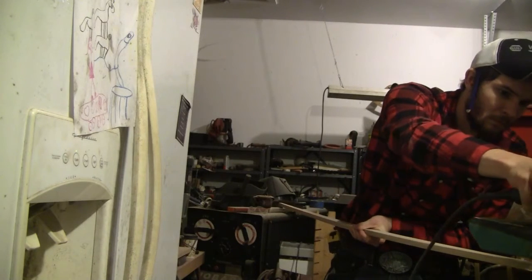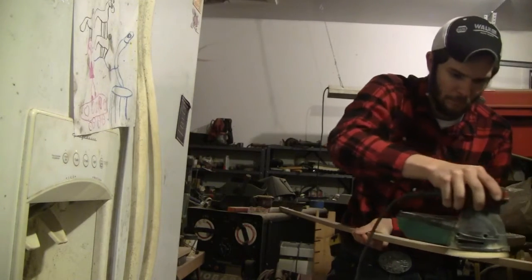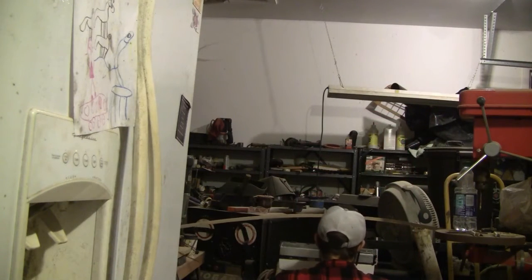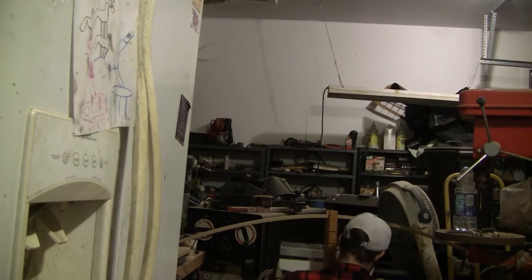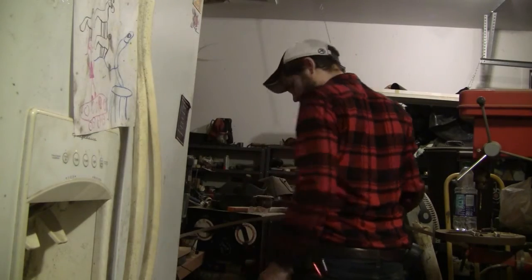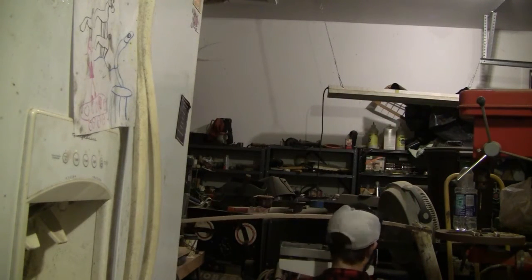Here I'm using my power planer to remove most of the wood, but I'm hitting it with an orbital hand sander every couple of passes to keep the wood smooth throughout the entire process. Once you're done with floor tillering, you're going to want to move to your tillering stick, which I made from a 2x4. I've got a notch cut from the end to allow your bow to nestle into it, and notches every 2 inches along the edge to slip the bow string in. You use your tillering stick in conjunction with a bathroom scale to gauge the draw weight of your bow. It's important never to draw the bow past its intended final draw weight, or you'll produce excessive set in your bow.